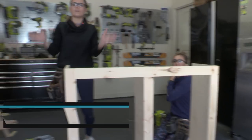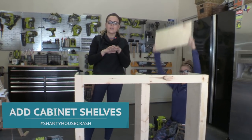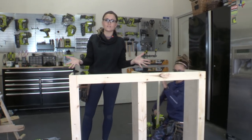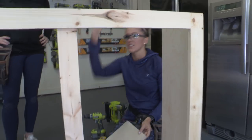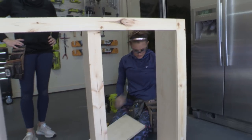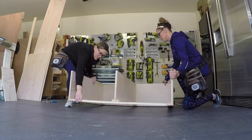Next step is going to be to add our shelves. We're going to do two shelves in this cabinet. You can put your shelves wherever you want to — we're putting ours close to center. We're putting Amanda's coffee maker inside, so we want to give her enough room to fit it. We're going to do ours 18 inches from the inside. We'll lay it down — that's an easier way to attach these. We'll pull it towards us just a bit and lay it on its face frame.